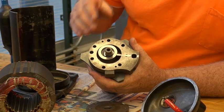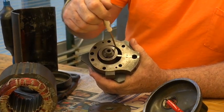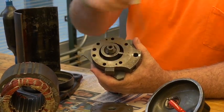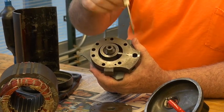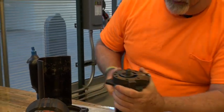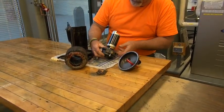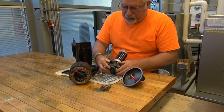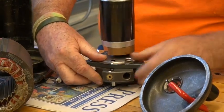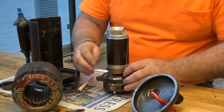Understand that it's consistent. As soon as this low side fills up, the high side has already expelled and pressurized refrigerant from the previous rotation. So you have a continuous flow of low pressure, high pressure, low pressure, high pressure movement in the refrigerant system. Now I need to ensure that when you go to put this back together, you put it back just the way it's designed — that's why we painted the little idiot stripes on here. Be sure that all the white lines marry up, set it down on its face, and then start dropping the screws in so they all line up.